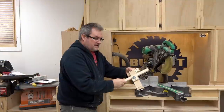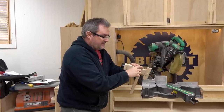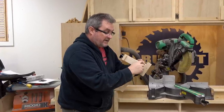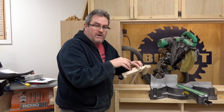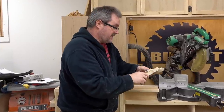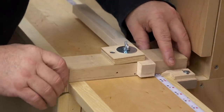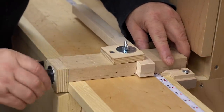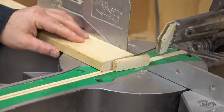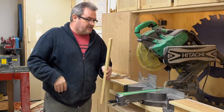I've got the stick put back in. The way this would be adjusted is the stick would go all the way back until this bottom piece that I added comes up hard against that, and then that lines up with the pointer I just put on. So the pointer will point to the place on the tape where the end of this stick is — that will be where your stock goes up against it to make your cut. And it is exactly 22 and a half inches long, so a good cut.